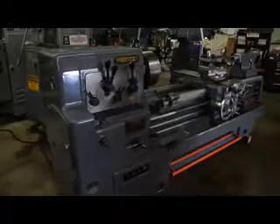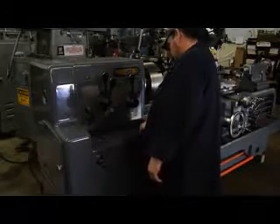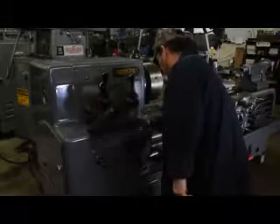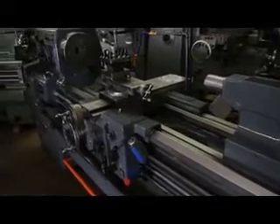Okay, 67 RPM. The one thing that we really want to point out on this machine overall is the absolutely amazing condition. Machines like this don't come around very often. That's 126 RPM coming up. This is a 10 horsepower main drive motor that's driving an A16 spindle taper with a spindle bore of 2 and 3/64 inches through the headstock.